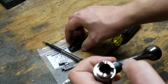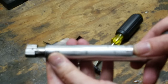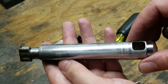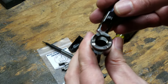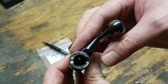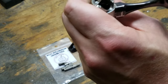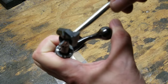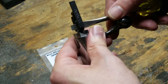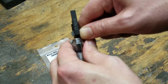Give it a little wiggle to find the notch. After that you can pull your bolt handle out and replace it if you want. You can sand, polish, and buff the bolt body to get it all slicked up and get rid of that zipper sound. To put it back together, just do the opposite: slide the bolt handle back in — make sure that groove is towards the top. Stick your firing pin and cocking piece back down the hole at that same angle, give it a little twist until it slides in, then twist it back until it's lined up with the stub of the bolt handle and pull your screwdriver out.